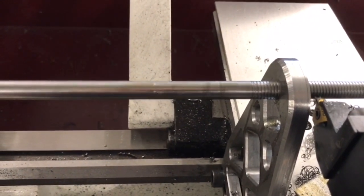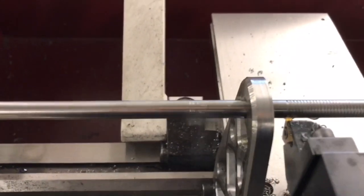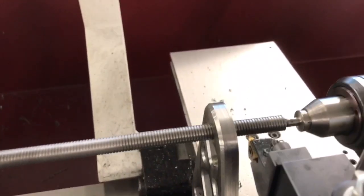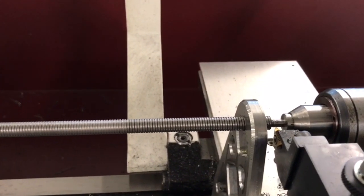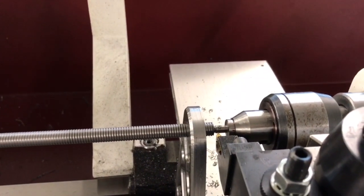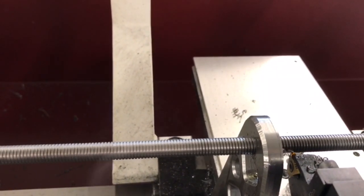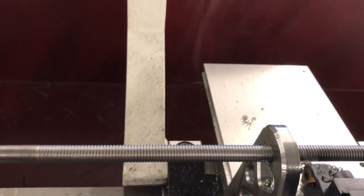As you can see here, we're not going to push off, we're not going to flex — this is actually a really easy threading process. And like I said, this will work for threading, but it won't work for turning because there is no way to accommodate the change in diameter, unlike you would with a standard follower rest. So a follower rest would be better in most situations if you're doing a turning operation, but this works really well for a threading operation if you've got a long rod. Right now we get close to the edge and there is no push-off — it's just going about cutting the threads just like it would if you were dealing really close to the lathe chuck.